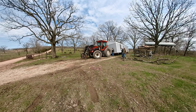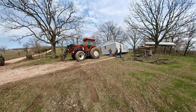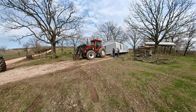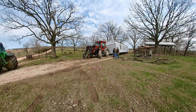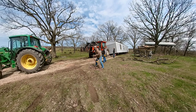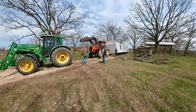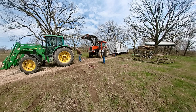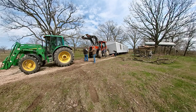From the clip you just saw it's pretty obvious that the front of the tractor is very light, for two reasons. One is that we have as much weight as possible on the three-point of my tractor to lift that trailer up as much as we can so that the mud it's stuck in is no longer all the way down to the frame. The other thing is we don't have any suitcase weights on the front of the tractor — we take them off because this tractor is primarily used for hay and we don't do any tillage work, so there's no need to carry around a thousand pounds of extra weight. We tied Jason's tractor to the front of mine to help keep the front end down, but even that wasn't enough weight — you can turn the wheels back and forth and see there's no traction on those tires.